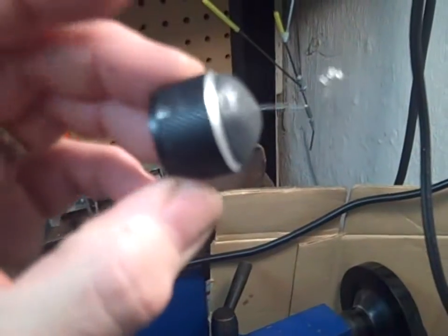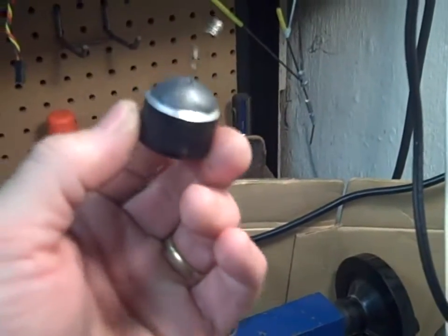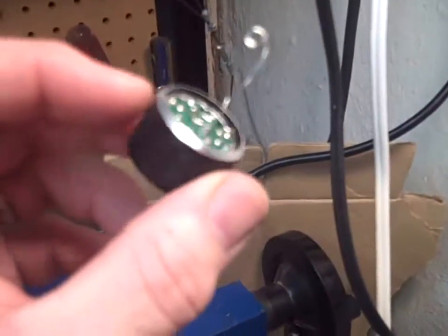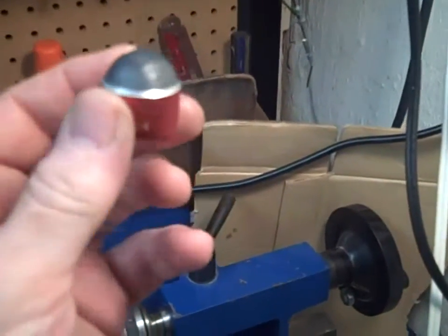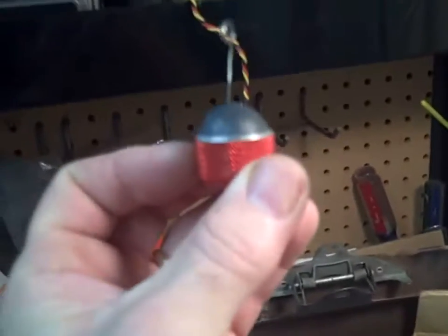You want all the putty to get inside of that chamfer so you don't see a break. The way I machine it, I leave a lip — I do that on purpose so the putty can get in there and hold up nice and tight, and then you just make a radius on it.